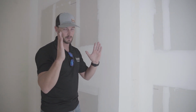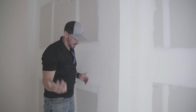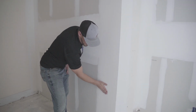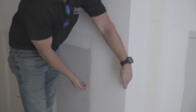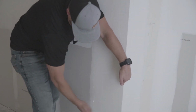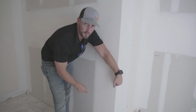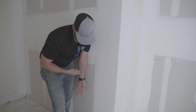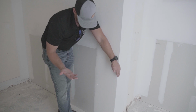And then third coat, we're possibly using even a little bit bigger of a taping knife. Again, we're cleaning it every single time, and we're floating it, pulling everything off the wall, nice and tight. So, I could take this section here and just take my flat blade, scrape off those parts. I'm not going to sand them off because that will take me a lot more time. I'm going to take my flat knife, I'm going to scrape them off. Okay, then I'm going to take my drywall sanding sponge.